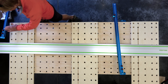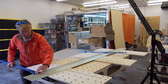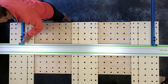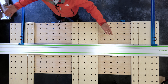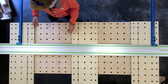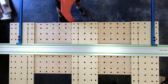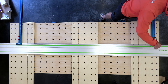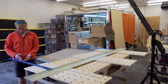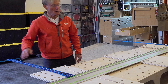The attachment to the rail is quick and simple — you take the right side and just slip it on the right side of your track. These actually sit right on top of your material, so if I'm going to rip a full 4x8 sheet I can just bring them in a little ways. Once I get them about where I want them I just take the provided tool and tighten these down. The scale is in both metric and imperial, so I can set it on inches or millimeters. And the stops are flip stops, so you flip them up until you get them on your material.